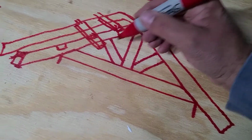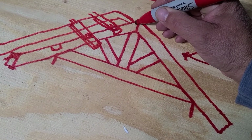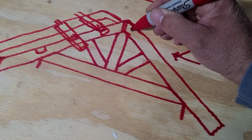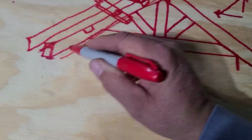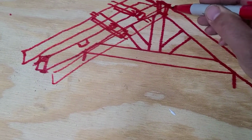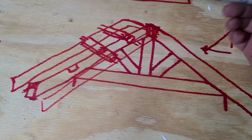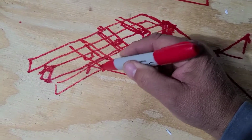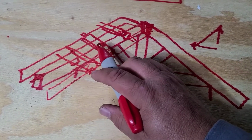Say you were using an 8-inch fascia board out here, you would use the same material here, and you'd cut a 1 foot block that would stick out from the top of your peak, and you'd screw that from the back side. Then you'd add your fascia board out here 1 foot out, and you'd screw into the end of those outriggers, and you'd splice it halfway on this block here, screwing in here, and then your other fascia board coming up with screws on the other side. So that allows you to run a fascia board and gives you an overhang out here over your gable end of your truss. And these, again, are called outriggers.